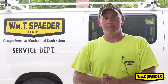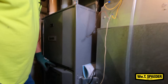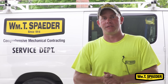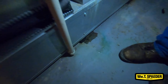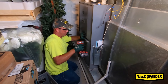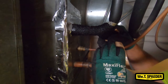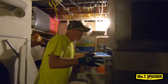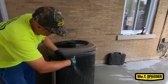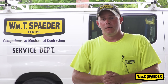We found a few things that were a problem. First, the condenser was dirty. Second, we found that the door switch downstairs had stripped screws. We also found an insulation problem on the suction line — it was leaking water onto the floor, which could be a potential hazard or concern for the customer. I installed new screws so the door switch and safety switch would not shut off. Second, I re-insulated the suction line downstairs to help with the water issue. We replaced the filter, checked our pressures, and cleaned the condenser outside. It's a standard cleaning check for an AC system and should be done once a year. We should also see you once a year for your furnace checkup.